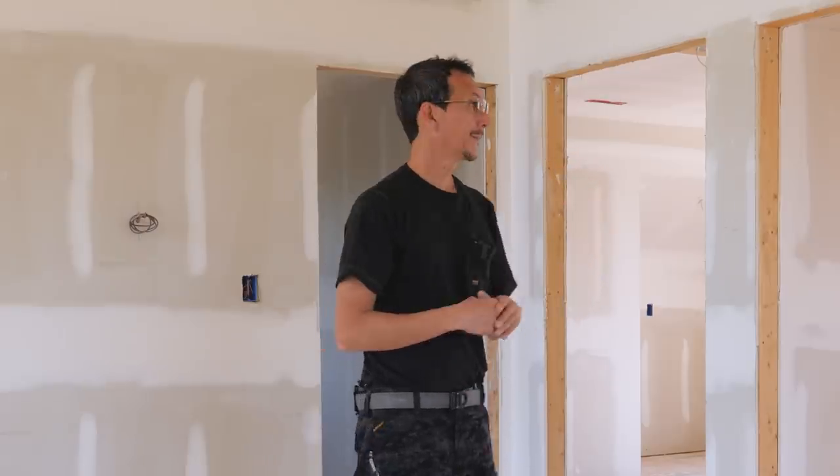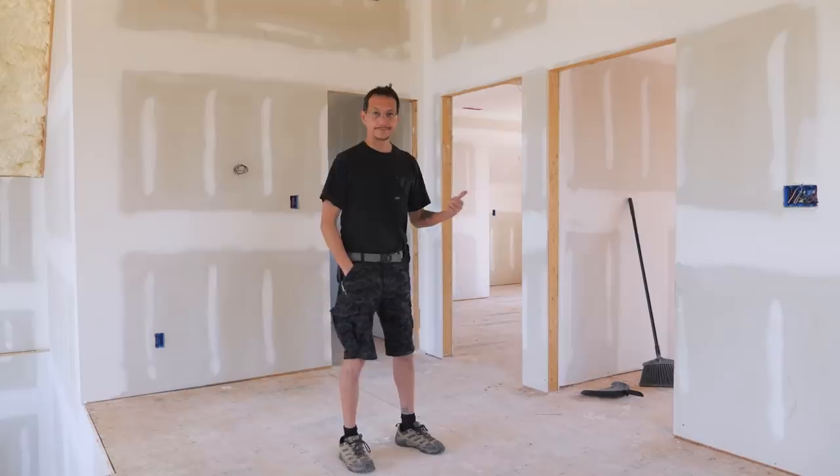But first, we're gonna clean off the walls and then we're gonna mix up some mud and play around with some different tools and techniques on some scraps to come up with our little formula to do the walls. I'm not gonna do all the walls. Places like closets and things like that where you don't really want a lot of texture to grab lint and dust and things, we'll leave those slick. Ceilings, we're gonna leave slick. This is more of just an accent piece type of deal to add ambience and texture to the walls, well, texture to the house. Let's get to work.